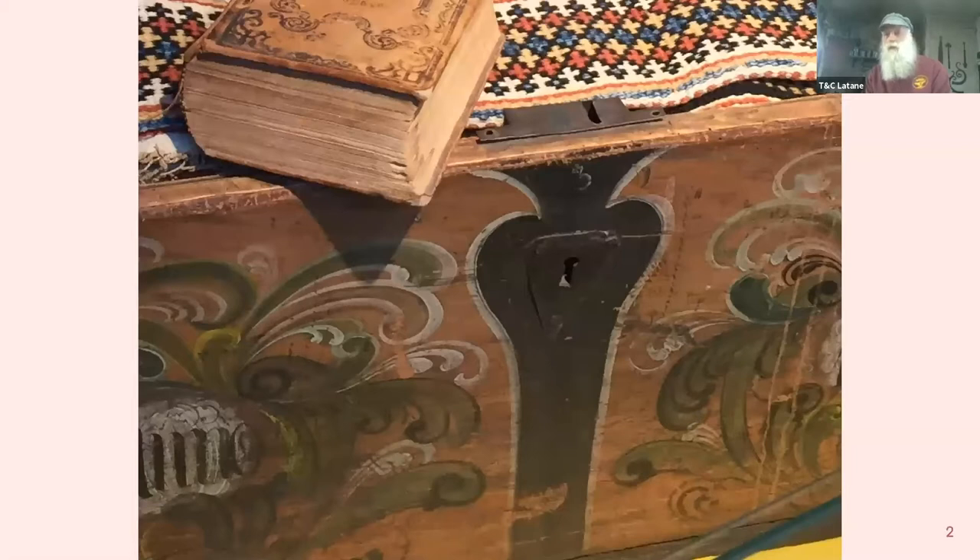This is a single pivoting hook block. When you see a single slot in the top of the lock that is narrow like this one, that's probably the type of block it is. Usually they're centered, but this one's a little off-center — there's always variation.